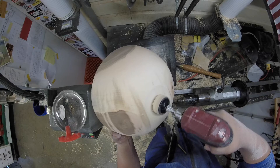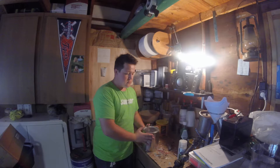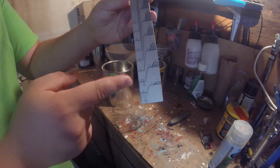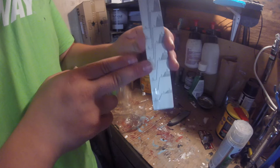All we've got to do is sign it and finish it. The bowl looks really really well. For finishing most of my pieces I use standard lacquer — for smaller stuff I'll use a quick can of spray lacquer, but this is a big bowl and it's gonna be around for a long time, so I've got a gallon of automotive-grade lacquer clear coat. I'll give it a quick stir, and I'm using a piece cut from a two-liter bottle with a measuring stick to measure out the ratio: I'll bring the clear coat up to the three mark and mix in thinner up to the five — essentially two parts thinner to three parts lacquer.